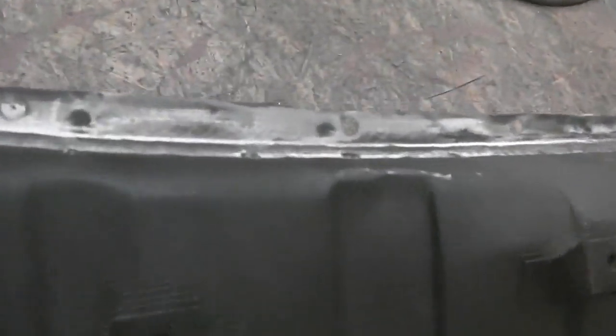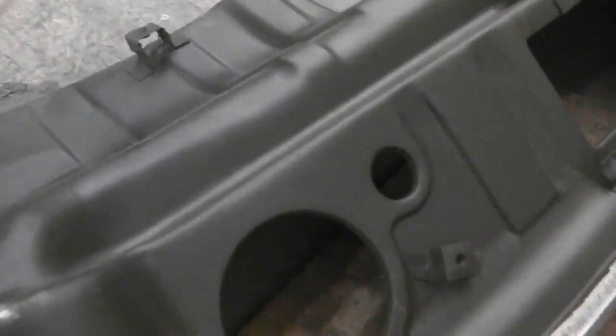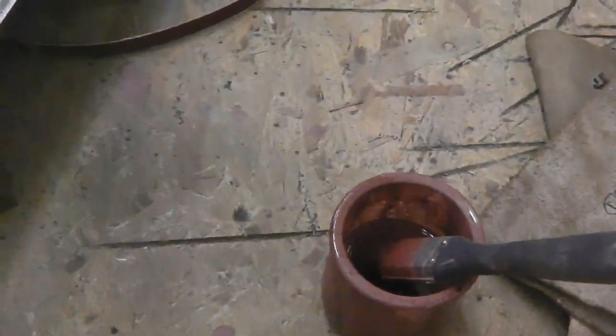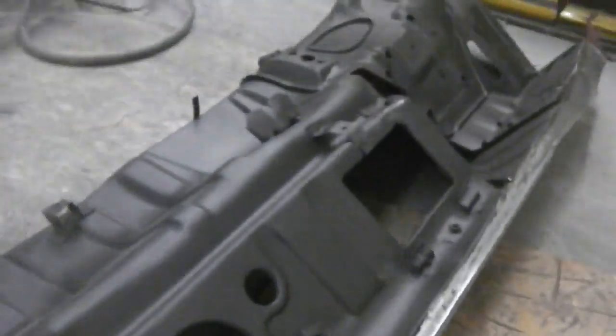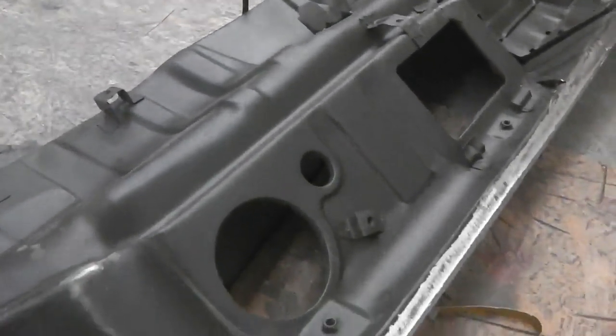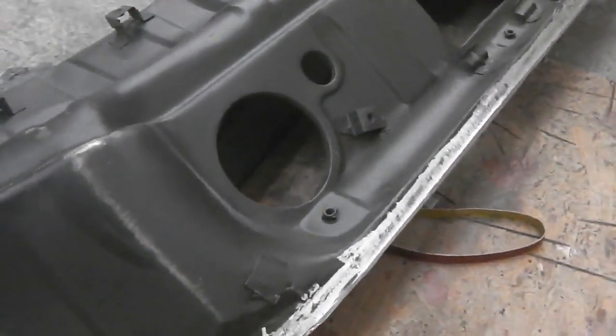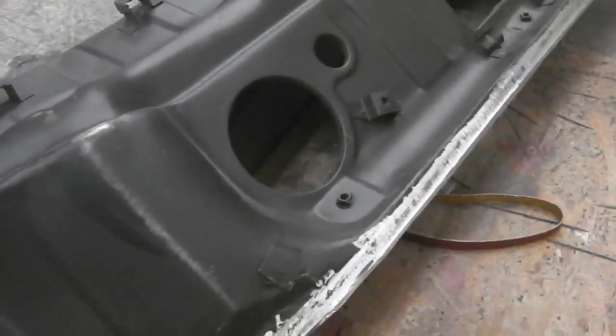So the whole way around, including the front face where the dashboard welds on, and now we just give it a bit of a one-two and round we go all the way round, and we'll start offering it up and get ready for some spot weld action, and some window measurements to double check. Weld through primer, next stage, bulkhead main panel going on.